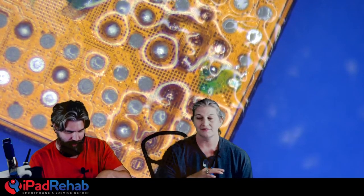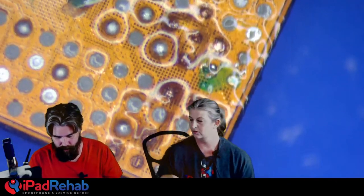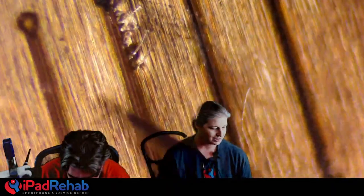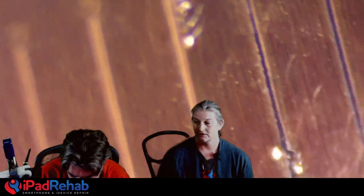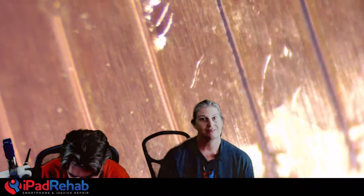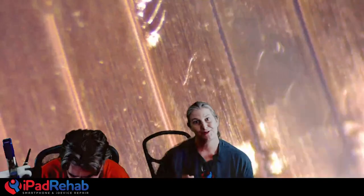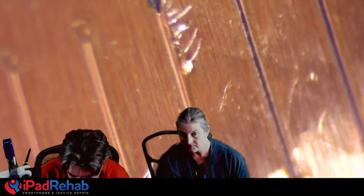And these, I would say 90% of crap that we try as new products from China end up going right in the trash can, as this is dumb. These have actually made the cut. I've been using them, and I plan to make a couple of videos. I wouldn't replace the smash ball technique with these things because smash ball is so quick for data recovery, but for repair, if you're repairing those split board models, these are really good. There's nothing else like this out there now, if you have to do this exact work, repair on the bottom of a chip where you're missing some pad. So these are fantastic.